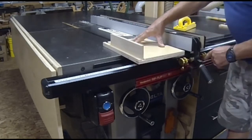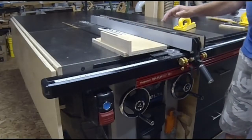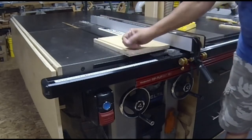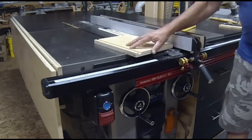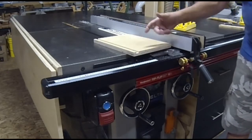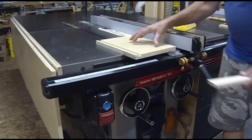The snugness is whatever you dialed in. It's that quick. Now, it's not as fast as a dado stack, where you can do it in two passes. But if you're in the middle of a project and don't want to change out your blade, it's handy to do with a single blade — in this case four passes, or three with an eighth-inch thick blade. If you're cutting drawer bottoms and need a quarter-inch dado, it's just two passes and you're there.